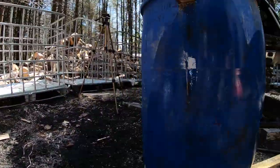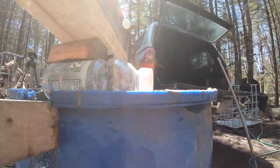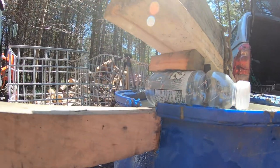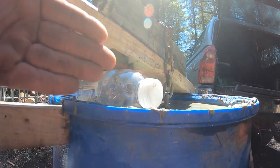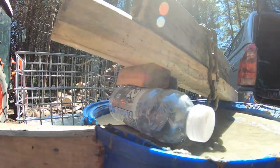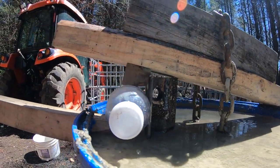So that sticks out there on both sides. That's a category one drawbar, pretty typical. I also put this piece of wood here. Don't laugh at the little barrel, but I put this piece of wood here to keep the channel open. And that channel I cut out, that's where the drawbar will get some articulation, some up and down motion. And I wanted to make sure it doesn't fill in with concrete. As you can see, there's the hole. That's where the pin goes through for the drawbar.